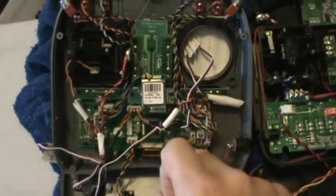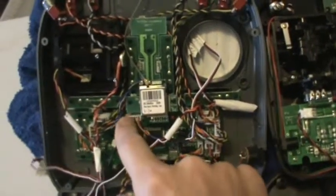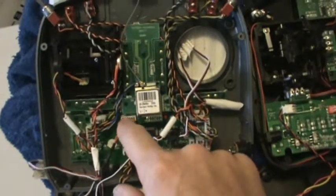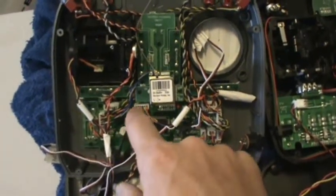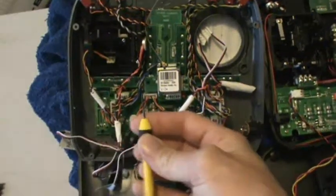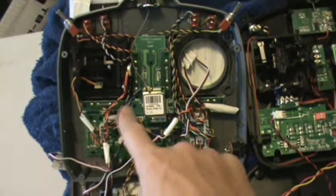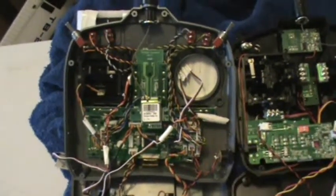If you're flying Mode 2, you only need to unplug the two leads coming from your throttle, leaving the other plug in place. On some controllers these leads might be hidden underneath a bit of circuitry, so you may need to undo a couple of screws and flip that over to gain access. Before you pull them out, it's worth writing down or marking where these plugs came from — use a coloured marker on the plug and further down on the board. Take your time getting them out as they can be tricky; a small screwdriver to help pry them out can be useful. Then temporarily put the controller back together, flip it over, and unscrew the four screws around the throttle stick unit. Open the controller again and the whole unit will come out.